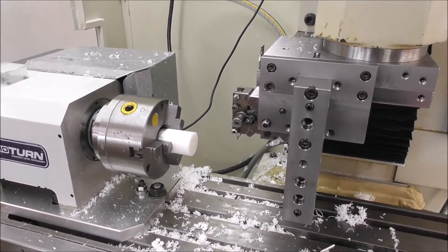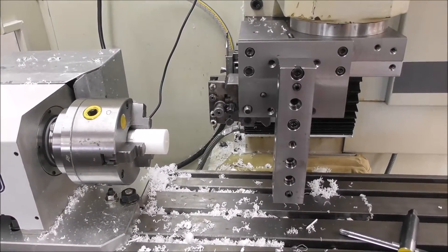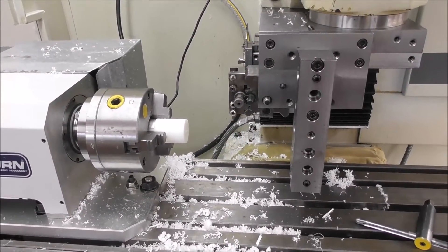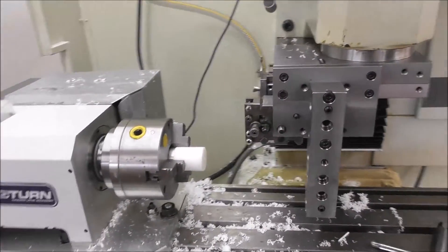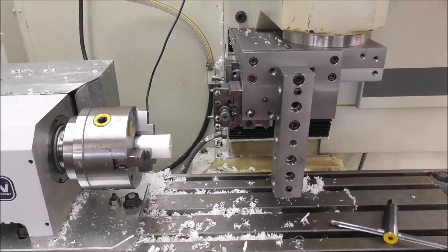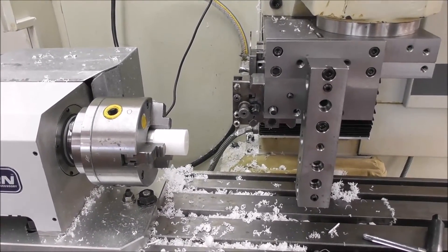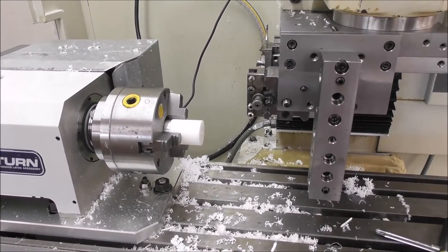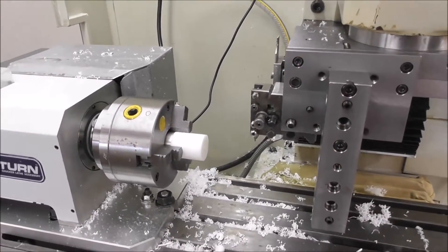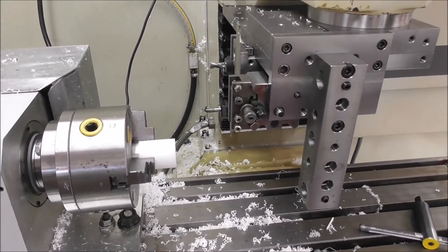When you're doing production machining and making scores or hundreds of parts, I think it's really important that the machine runs automatically without any operator caring for it or removing chips. The cycle time doesn't matter so much if you're away doing something else and it can just run quietly by itself. But it has to be able to run automatically without an operator keeping an eye on it. You have to think about removal of swarf or chips — you can use a chip breaker, have the tool retracting rapidly, use tentative moves with the boring bar or turning tool, or use compressed air to blow chips out.